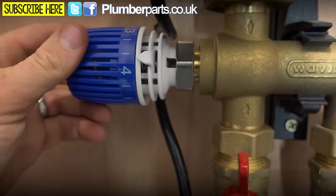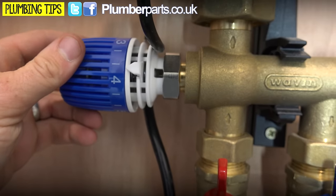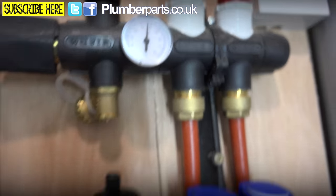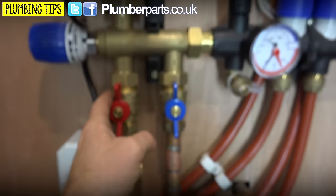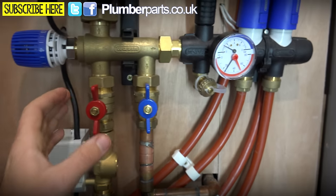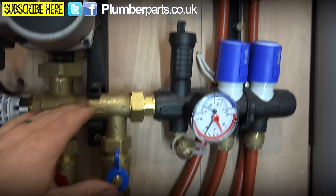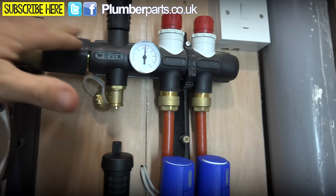So what I'm doing is just shutting this valve here, just like so, you just shut that. And as you can see, what that's doing now is that's shutting off the hot water that's coming in from our boiler and turning this into a loop. So the cold water coming back from the screed and the underfloor heating is cooling off at the moment.